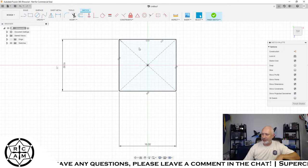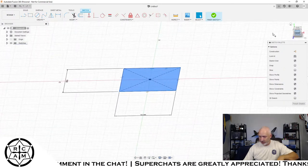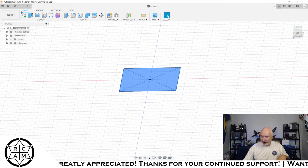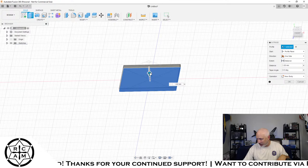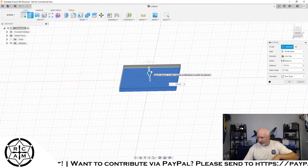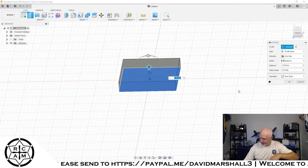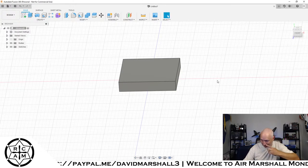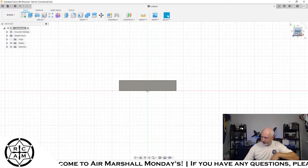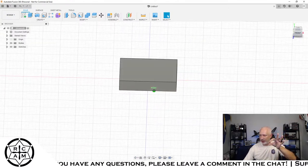So the first thing that we'll do so we can get a usable part here is we're going to extrude this square. In order to do that, we have to finish the sketch, get our blue part, extrude it, and we're going to come up by, let's see, that's 1 millimeter. We're going to have about 1 millimeter walls too. We're going to come up about 3 millimeters on that base. And we'll get into the why here in just a second. So now we've got a small square that the VTX will sit right on top of.